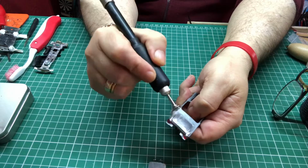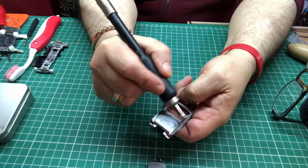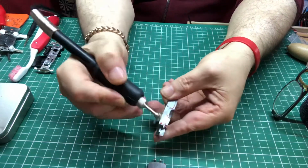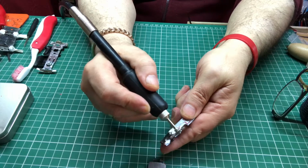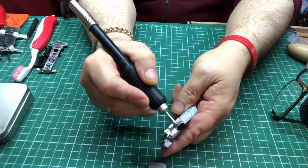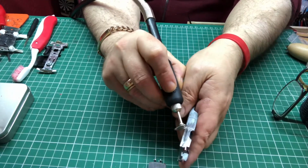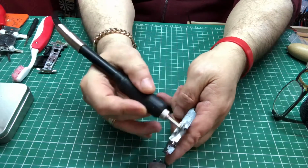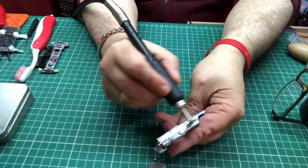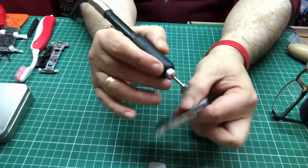But I've actually, in a previous video, not in this because it was filmed after this one was, found a little tip to combat this issue. Basically, all you do is get yourself some super glue and run it round the disc itself, around the centre on both sides, let it dry, and then it'll seal in the little spikes. It seals them into the bit, I should say. They do still come off, but where I was averaging one and a half cars per disc, I'm getting like 5, 6, 7 cars before it's going baldy. So it's making it more cost effective and less dangerous, so to speak, with the little missiles that fly away.